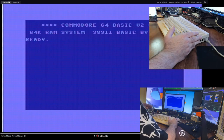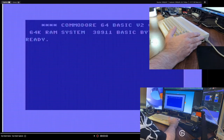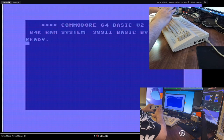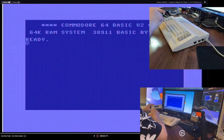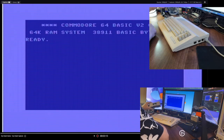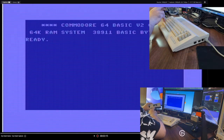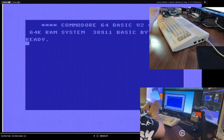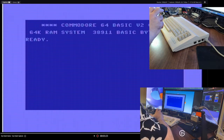So I have this power supply here off to the side, which is a third-party replacement. I have opened this just to look at what was actually on the insides. It seems absolutely fine. The voltages check out. It's got the 9 volts AC and the 5 volts DC. Right now it's upside down, but it's still saying that it's 4.92 volts. We'll take it at its word.